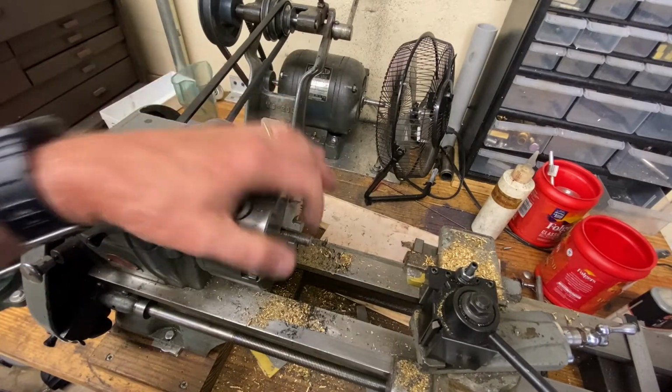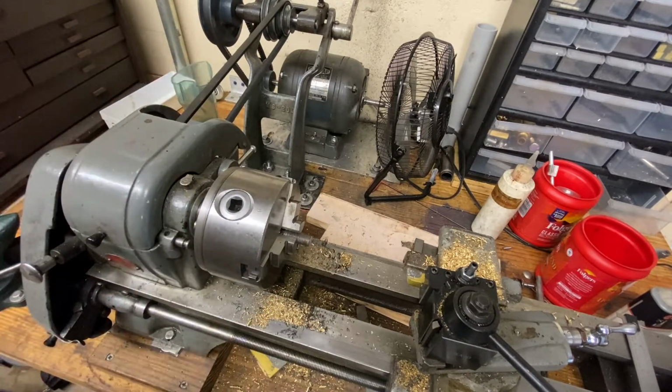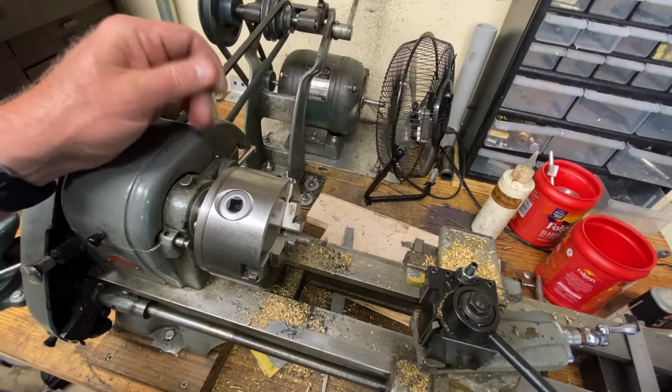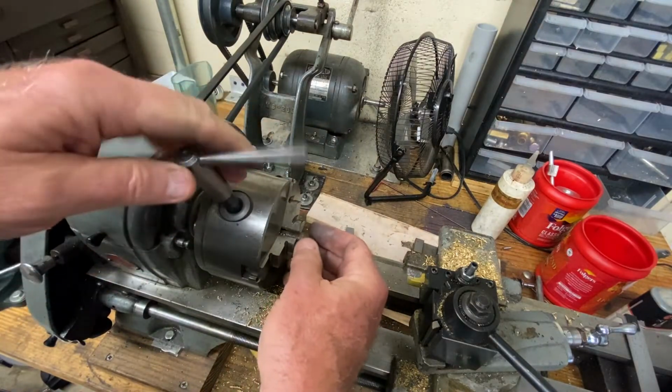Unfortunately, I'm all out of aluminum can, like pop can, to wrap this up in the jaws, so I don't have it very tight. I don't want to screw threads up, but again, it's not a precision thing, so it'll probably be fine. I can always chase them with a die, but I don't want to make extra work for myself.